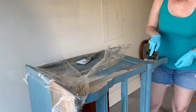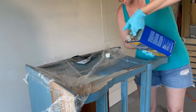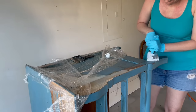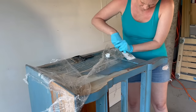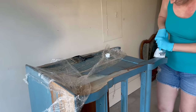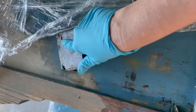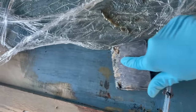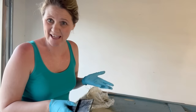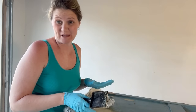I waited about 40 minutes and noticed that this paint just wasn't budging at all — it didn't even look like it was coming up. I had never seen paint do this before underneath chemical stripper. I added a little bit more to see if I just needed to get it a little more damp and move it around, but nothing. This blue paint was not budging whatsoever. It is not working — it's plenty damp, not dry at all, and I'm barely getting any of this paint off. If the stripper is not going to work, I'm going to have to go to Plan B.